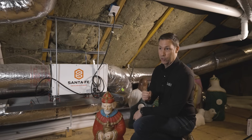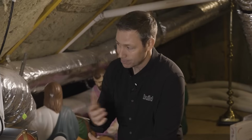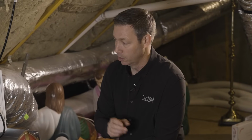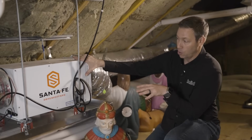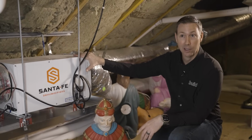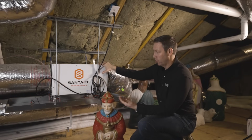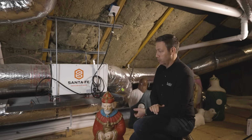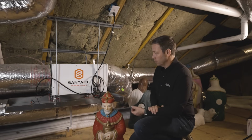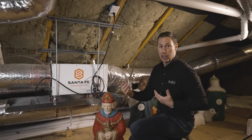Remember, those are just rules of thumb. And when it comes to your actual house and your actual location, your humidity, the people that are in your house, you're better off with a slightly bigger unit. The last thing I want to mention on that is this unit does run a fair amount because it's a smaller unit, and I suspect my kids are taking 45-minute showers as teenagers. So it's working hard. Had I had a slightly bigger unit in here, the duty cycle would be less, which means that it would probably last longer. I suspect that this one might go out prematurely compared to a slightly bigger unit that had to run less.